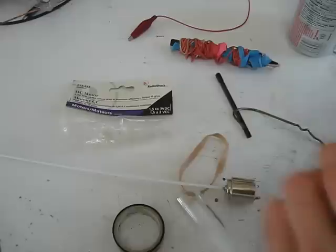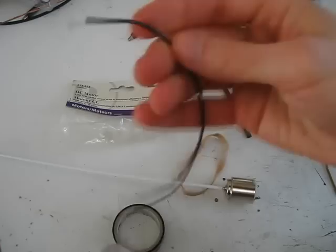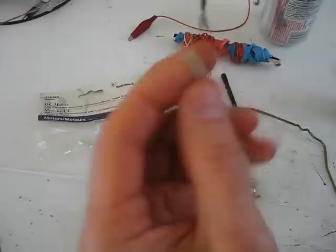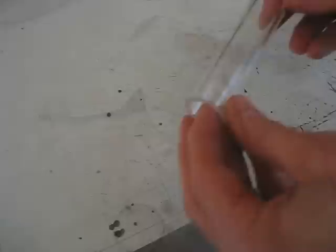For the ball at the top, I'm going to use this Coke can right here — I just got this from a neighbor's recycling bin. For the brushes, I've just got some wire here; it's fairly thin stranded wire, so I can use the individual strands. That's what will face the rubber band or the belt in order to pull off the charge and to put on the charge. So those are all the parts — now let's assemble it all and see if it works.